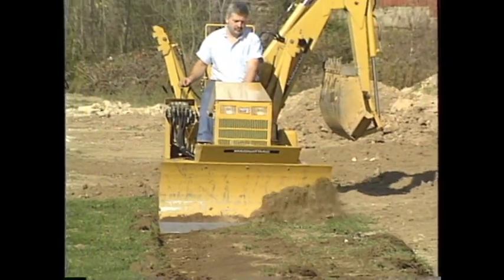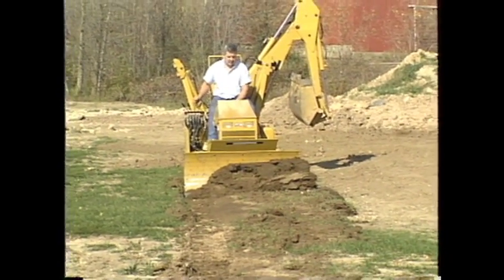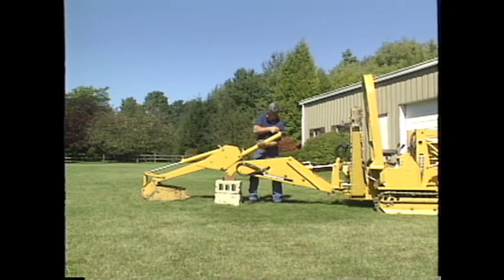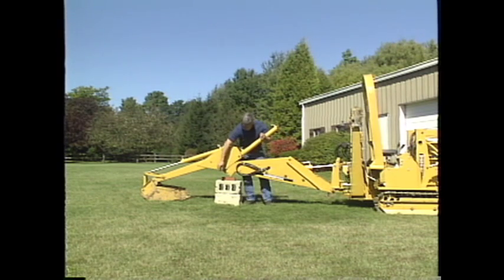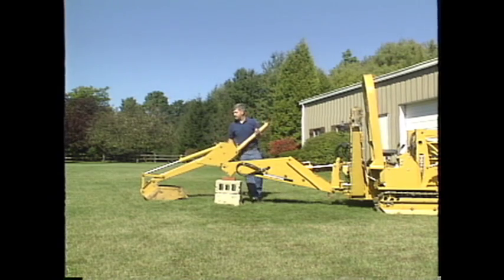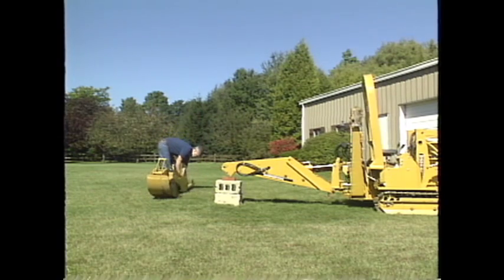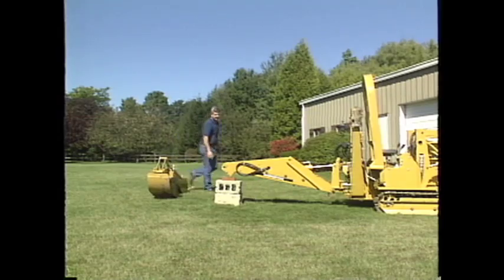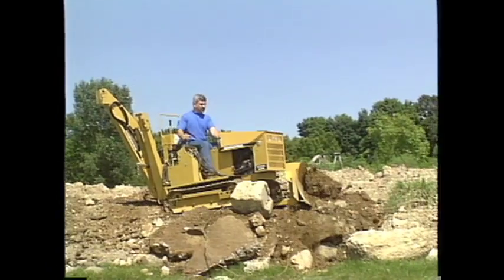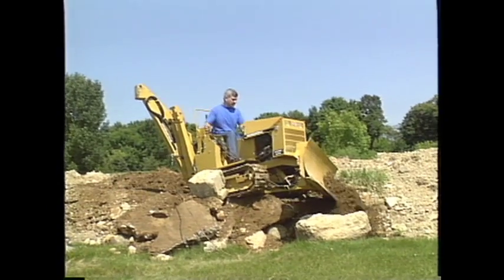If you need additional rear clearance and overall compactness, you can rotate your backhoe's boom and dipper against the backside of your Magnatrac. If more clearance is desired, you can spend a few minutes to release 4 hoses and remove 2 pivot pins. This will allow you to fully remove your bucket, dipper, and 2 control cylinders. This procedure will greatly reduce both your rear overhanging weight and your overall tractor length. Rotating the remaining boom against the rear of your HYDRO will further reduce your overall length, allowing you to work in even tighter spaces.